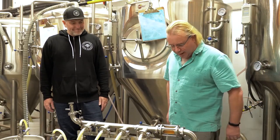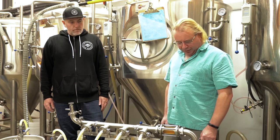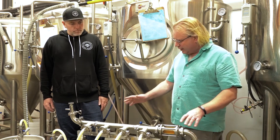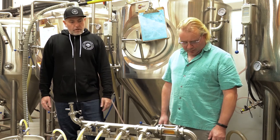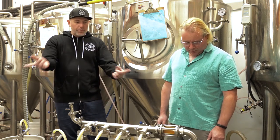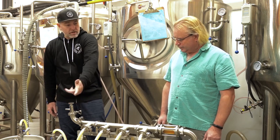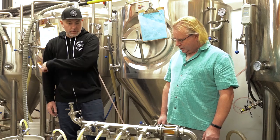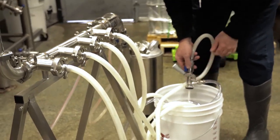I'm here with Vito at Imperial Beer Project. He's letting us test out our new keg filler, and I wanted to go through some of the things we did when we got set up. We filled a couple of kegs already. So Vito, how did you end up sanitizing this to get ready to go? I used a service keg, filled it up with sanitizer, just pushed that through with gas and let it out. I like this feature at the end here — it's nice to be able to get all that gas out and allow liquid to flow through, and then I opened up each valve on all four to push sanitizer through there as well.